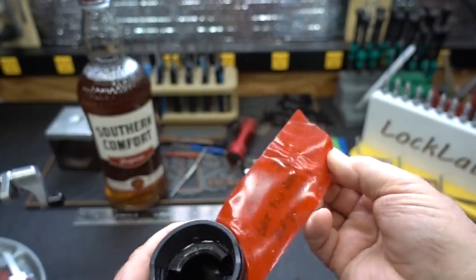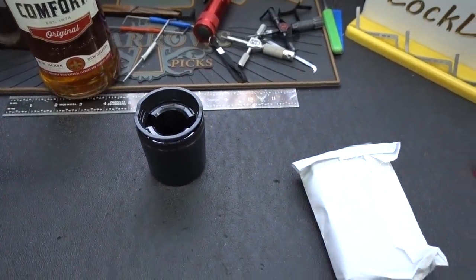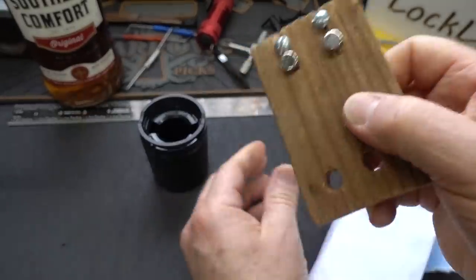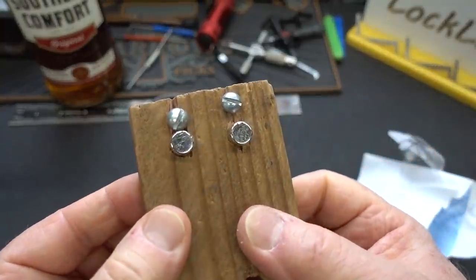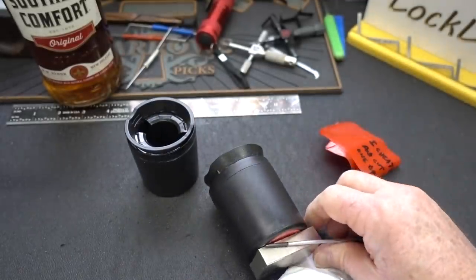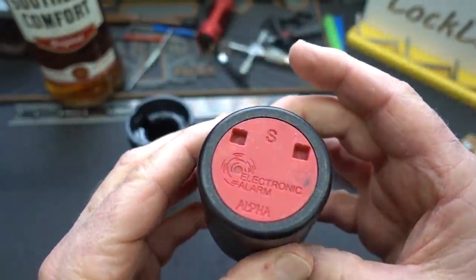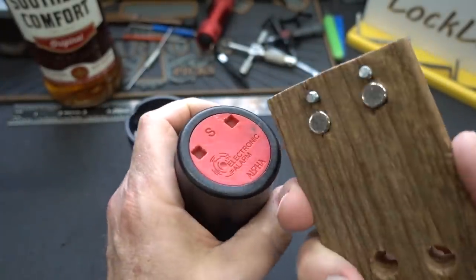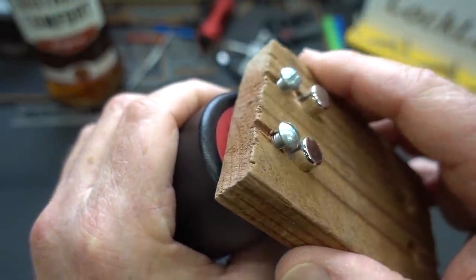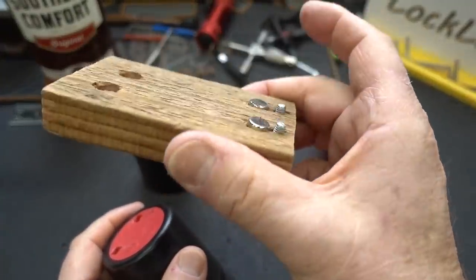Let's go ahead and pop this guy open and see what we got. Let's first take a look at his homemade key, then we'll take a look at the innards of this lock. So he's taken two magnets, and it looks like he's using these screws for the tensioner. Let me find that lock and try this correctly. I'm going to lock it, push that back — so that would be locked. Then take the key and place it in those two notches. And I hear it clicking — you can hear something inside clicking. Then turn it, and it pops open. So it works exactly like we thought, except instead of four magnets, it looks like there's only two.